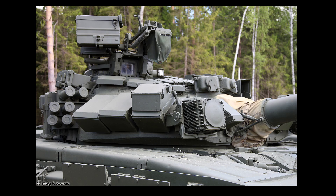In essence, the T-90 is a T-72B on steroids that received mostly upgrades in the fire control system. Russia simply adapted the fire control system from T-80U and T-80UD tanks — the 1A45 — into the 1A45T, also known as IRTYSH. Also, the T-90's tank commander received a newer cupola based on the PNK-4S cupola from T-80UD. This cupola design is superior to the T-72 series cupola — it is fully stabilized and has a remotely controlled machine gun as well as much better optics.